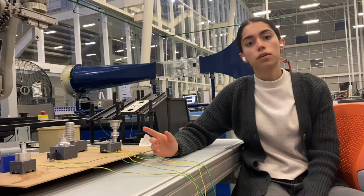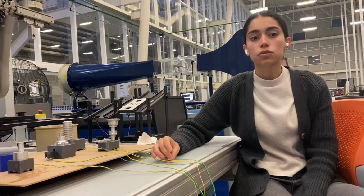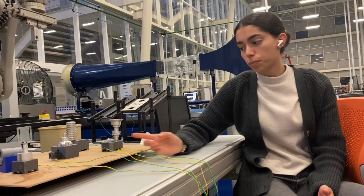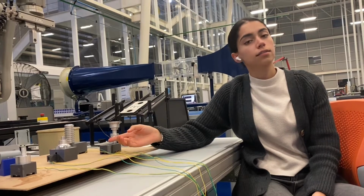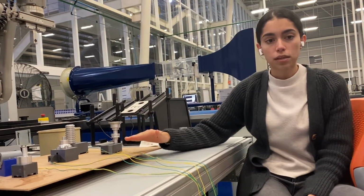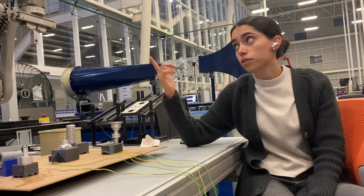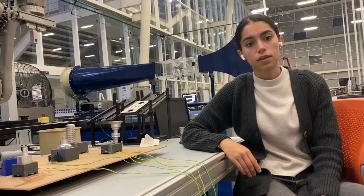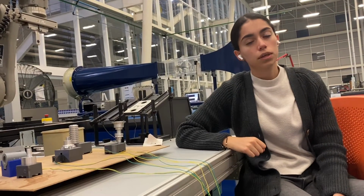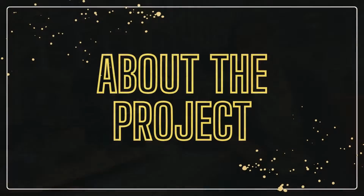Each part was manufactured with Poka-yoke techniques to ensure a perfect assembly every time, regardless of the person who performs the assembly. Bases for each part, built with Poka-yoke techniques as well, were 3D printed to position the parts in place for the assembly. Then the Motoman robot was programmed to perform the whole assembly process. Once it finishes, the robot automatically returns to its home position.